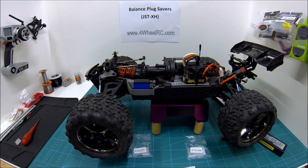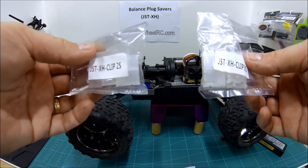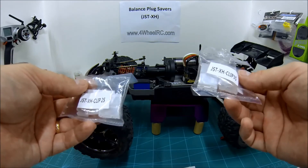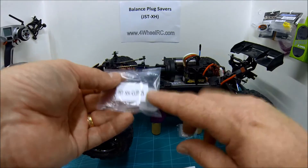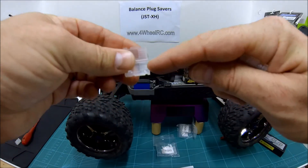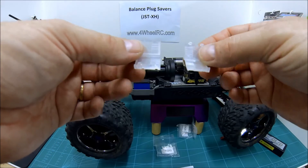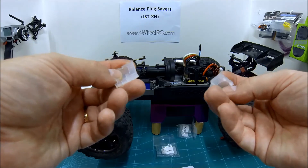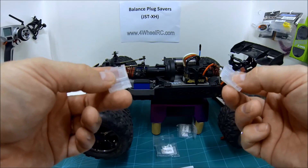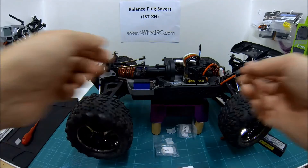Personally I think they're great — a really cheap product. One thing to remember before I finish: get the right ones. Don't do what I did, which was buy some 3S ones when I don't have 3S batteries at the moment. They come in different sizes because the number of wires coming out of your pack varies: a 2S pack has three wires on the balance connector, whereas a 3S pack has four. As you go bigger — 4S, 5S, 6S — you get different sizes. Just make sure you get the right size connector. Also do shop around; I got these from Hobby King but I've seen them on eBay for a lot more money for exactly the same product. Hope you found this video useful — if you did, give it a thumbs up, and post any comments or questions below. Thanks for watching.